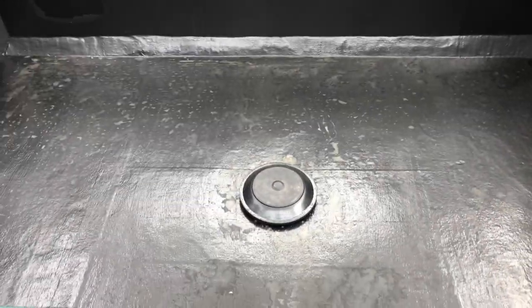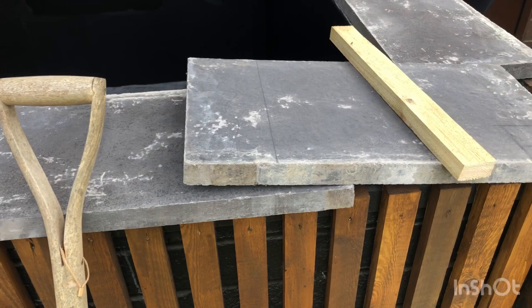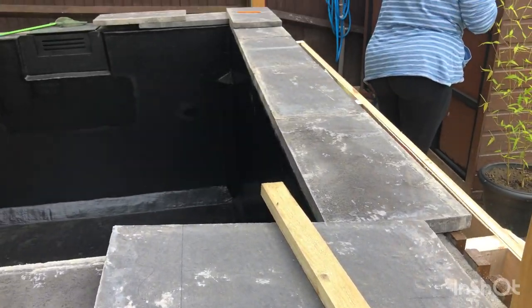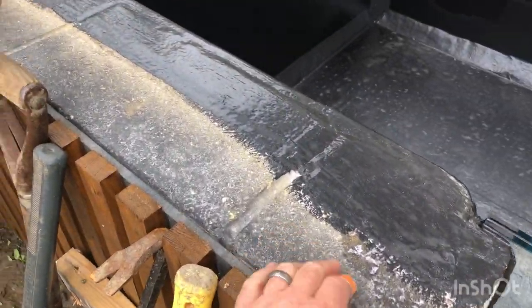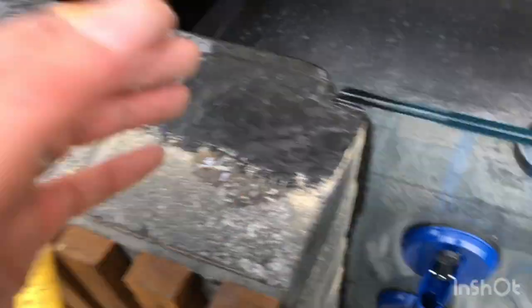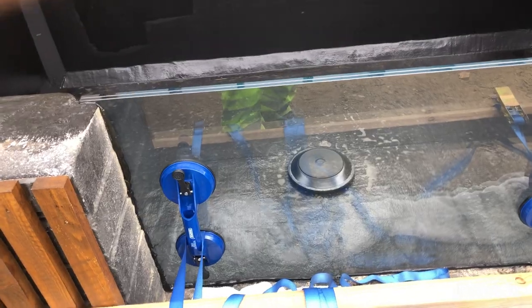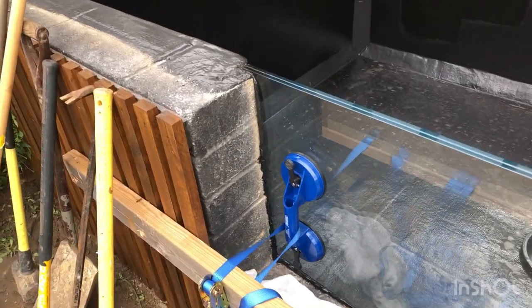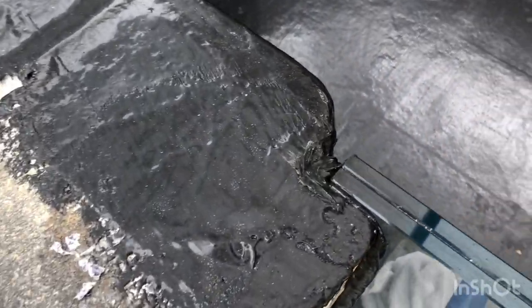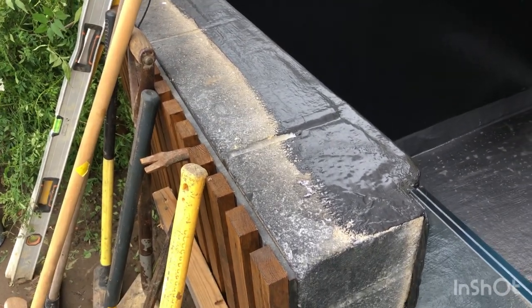It's sitting on that brickwork, nice and solid. Bottom drain's in. What I'm doing now is just getting these coping stones up so I can pencil in the cuts and do them all at once. Then I'll clean this off - it's been sealed with paint anyway. The window went in with the PU18, which you can get six for about 24 quid - a lot cheaper than CT1 - and it seems to have done the job. I'll use PU16 and a bit of No More Nails just to hold the coping stones on.